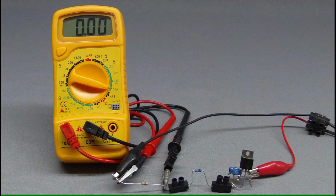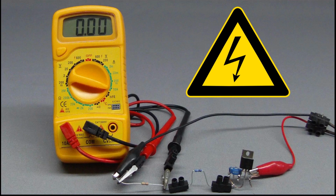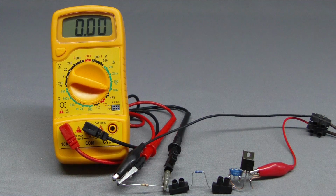Be careful while doing measurements with multimeters. Like mentioned before, the test circuit will only be attached to low voltages. Never touch uninsulated wires or devices at unknown circuits while they are attached to a voltage source. While doing measurements with the help of a multimeter, be sure to switch the device to the correct function before attaching it to the live circuit. Don't switch between different functions while the multimeter is connected to the circuit under test.